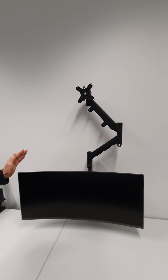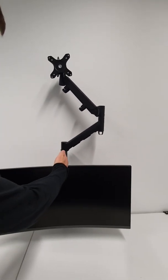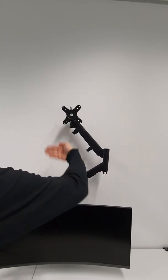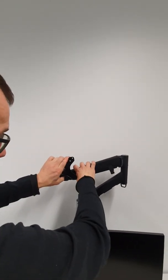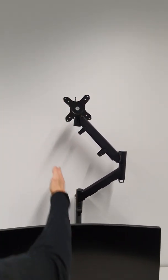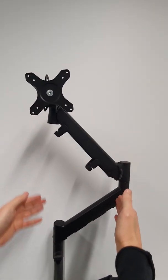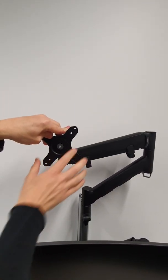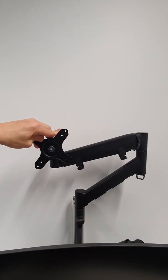A final consideration is to be aware that the centre of the monitor will be slightly offset from the position of the post. This is a combination of two things: all dynamic arms move through an arc, so from highest to horizontal and back down there's a movement to be considered. Also, the geometry of this arm is such that the links are slightly different lengths, meaning when the arm is in a nominal position it will be offset from the centre line. In this particular installation, we're looking at about two to three inches offset between the centre line of the monitor and the position of the post.